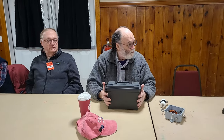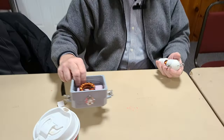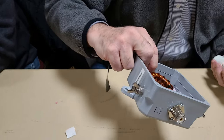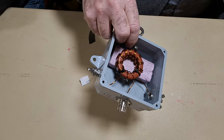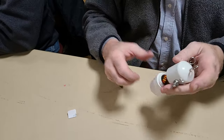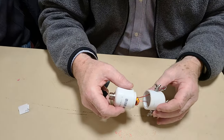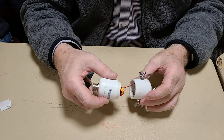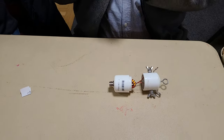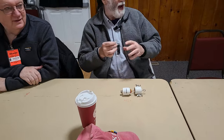Do you want to send that around? Sure. John, the toroid — was it a 9-to-1, the balun? This one here, yeah, it's a 9-to-1. And how is it capable of handling it? It's on 16-gauge wire, so it's probably good for 100 watts. It's in the donut — with a 43 mix? Yeah, it's a 43 mix. So Wes, if you wanted to have like 1,500 watts, what do you need? Two donuts plus number 12? I'd go with at least 10 wire and three toroids. I don't think I would do that. Yeah, and then it would blow up anyway.